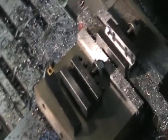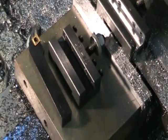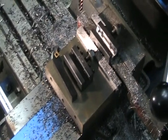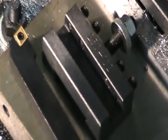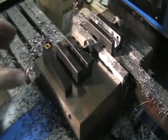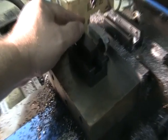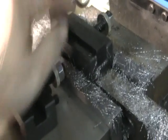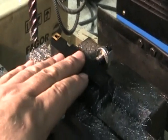Here is the part. I've got the 250-100 quick change tool post and I have the part that I've machined out inside the vise. Sitting next to it is the second original unmodified part. You can see I've actually opened it up some. The part that I've got here doesn't fit in the original one, but over here in the new cut part, you can see it fits right in there. I've got a good tight fit — I went to 6.4 rather than 6.5, basically 6.41, just so I had a good snug fit. It does fit very nicely.